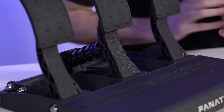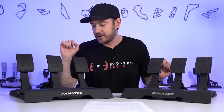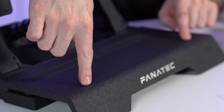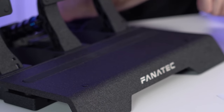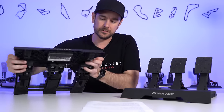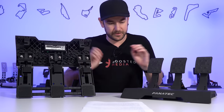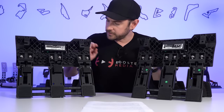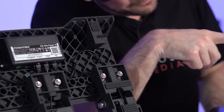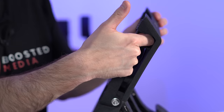The two things you'll notice if you look very closely: slightly different assembly for the load cells — the load cell has been completely revised. You'll also notice two little plugs in the front now, whereas before it was just a solid piece of aluminium all the way across. That allows easier access to the mounting holes on the underside. There's now a groove rather than a hole, so you can slide the bolt in rather than having to poke it through the little hole, which was quite clumsy.